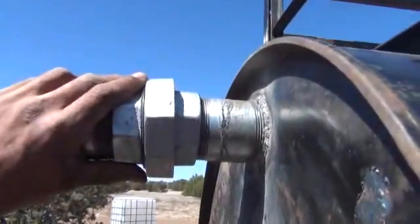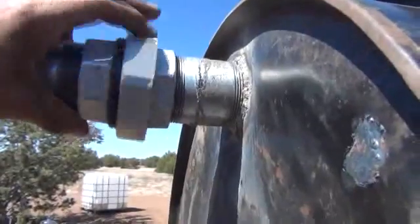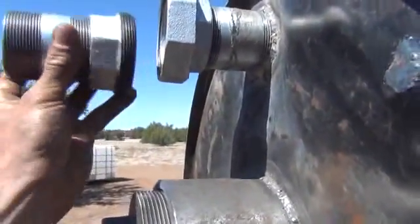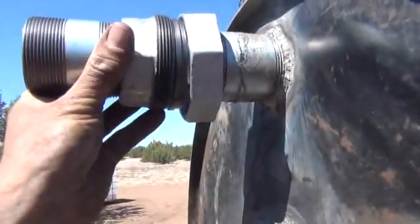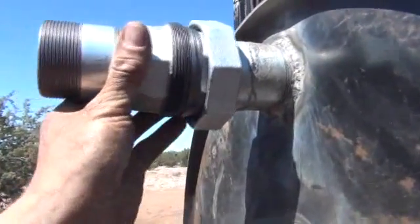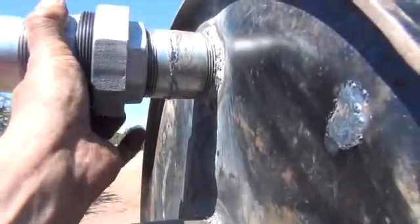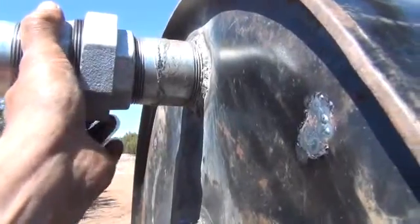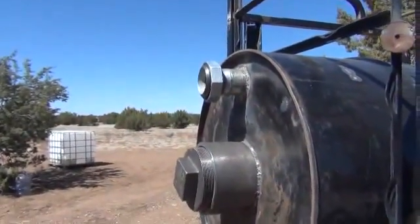The other side is our gas output section. What this is — just to show you — is a coupler. This coupler allows this section of pipe to be hooked directly off of another one going to our fractional distillation column that we're going to use to first distill out the different agents we're looking for out of the bio crude reactor. That allows you to just come straight up to it. You don't have to actually spin the main pipe — you can just spin this collar. That allows you to hook that together nice and tight and you've got a good gas seal all the way across.